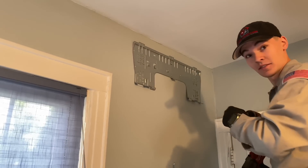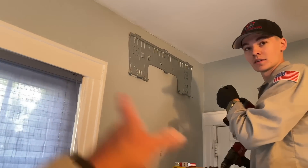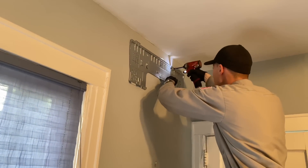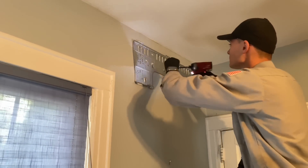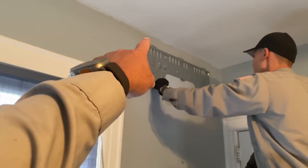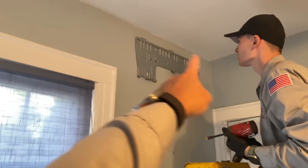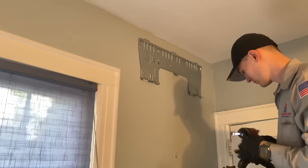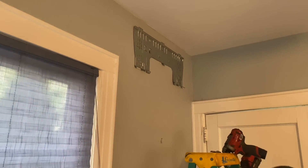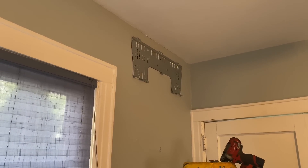We drill the pilot hole out the wall — you're going to be clear outside. It looks like I should be okay. Securing the wall mount bracket — it's very important to get the top left, top right, bottom left and right, because that's what those clips are. You don't want the thing moving around at all; you want it nice and secure and one with the wall. We should drill a pilot hole with the masonry bit and drill from outside in.